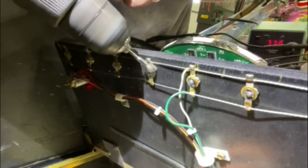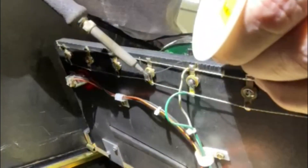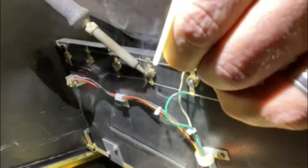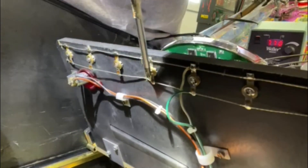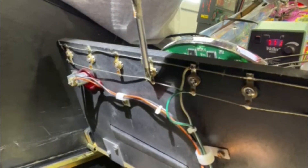The way to fix that is you're going to take your wire brush and rough up the entire edge so the solder has something to stick to. I also stick the lamp in and then do the bottom of the spring again. Now I'm going to take some solder, put some on the end of the spring so it sticks, and put it on the edge of the lamp socket so that sticks. Then I'm going to take another screwdriver and push the spring in while it's hot, holding tension on this thing the whole time while it cools off. And once it's cooled off, it'll stay.